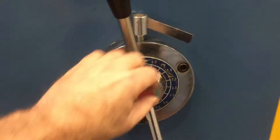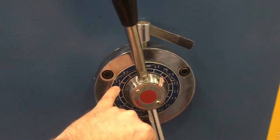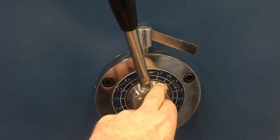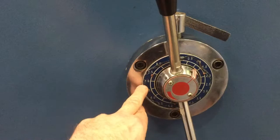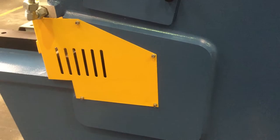On the side here we've got our rapid blade gap setting. As you can see, you just quickly loosen that off and bring the lever around to whatever desired cutting thickness you're using. It runs from around 0.5 to about 8mm. To get optimum cut finish, if you're cutting up to 3mm you can leave that in the 2.5 to 3mm section. If you're cutting thicker material like 6.5 or 8mm, bring it around so it gives you a nice clean cut. 250 side throat is standard on our swing beam hydraulic shear model, so you can take those covers off and side-slit if need be — that's a fairly handy feature.